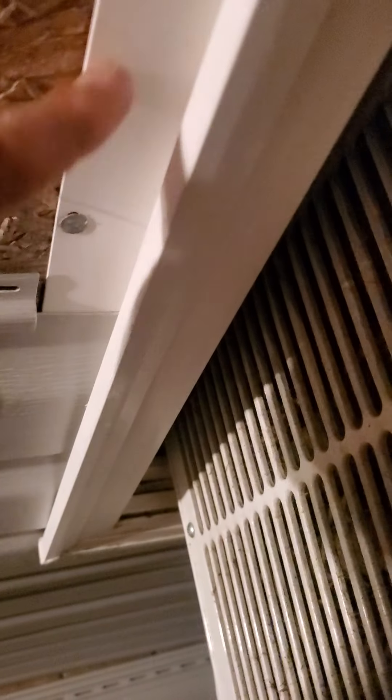So what I mean to say is I lucked out. These windows here — some people say you've got to put J-channel in them. I don't usually. Once in a while I will if I've got extra J-channel laying around. But windows like this are probably not going to get J-channel. It's basically a J here already. See how far in the window goes? I might put a couple more screws in the top where they're missing a few. This comes back past the siding — you always want your siding to be able to slip a little.